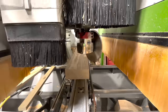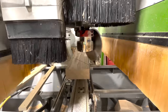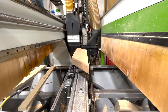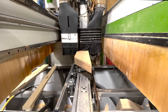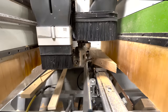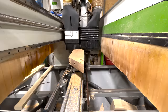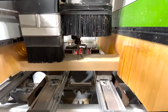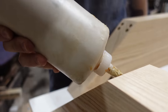First we come in with the saw blade, and it's actually going to cut these pieces to the exact size we need. John's just using a stick to carefully catch it when it falls so we don't get any tear-out. Then the CNC comes around to do the outside perimeter after the saw blade, because the three-quarter compression bit will give a much cleaner edge. It's also going to come along and drill all of our dowel holes needed for our glue-up — hollowing out a recess for the joinery and then adding those three dowel holes.